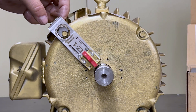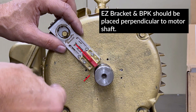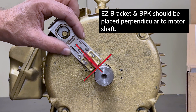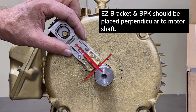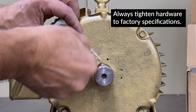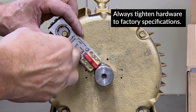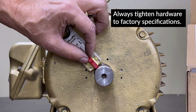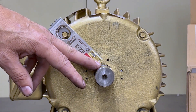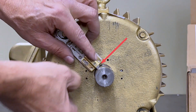With the mounting clip and bracket installed and the bearing protection kit fastened in place, the last step is to adjust until the bearing protection kit is making physical contact with the motor shaft. Bring it down until it's tight, then tighten down our adjustment screws. Properly torque and remove the clip. Remove the retaining clip, slide it out of the way, releasing the brush against the motor shaft.